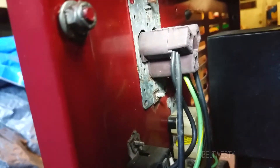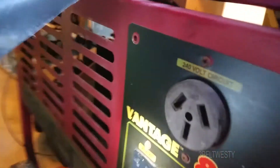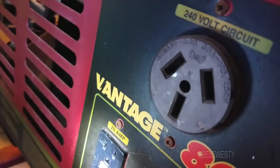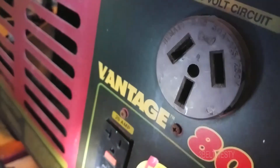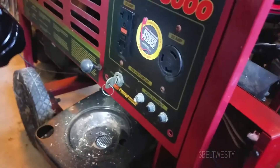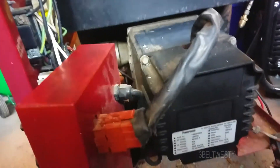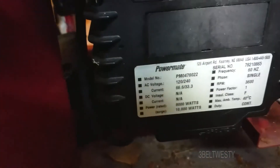I've been trying to revisit this thing since I got it off the street from the curbside. I was kind of dumbfounded because I was told that was the neutral — which didn't make any sense because it's a green wire. Most generators on 240 volts have a neutral so you can hook them up as a sub-panel for backup power, but this unit doesn't. It's an old Coleman Advantage 8,000 watt unit with a flathead engine, an oil filter, from 1998 — so it's going to burn more gas because it's a flathead.